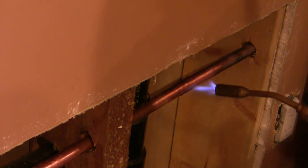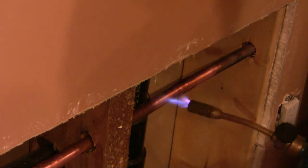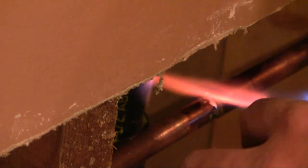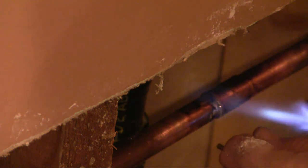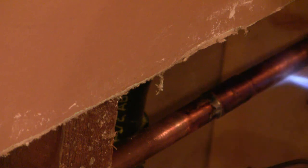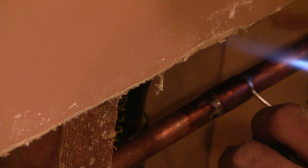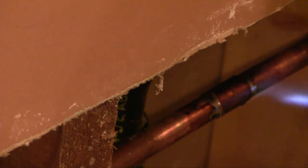It's a lot like welding and brazing — you don't necessarily heat the exact spot you're going to be soldering; you heat the side of it and the solder will wick its way into the crack. You don't need a lot. I don't need to go all the way around — the wicking power is so strong it tends to draw itself in everywhere.